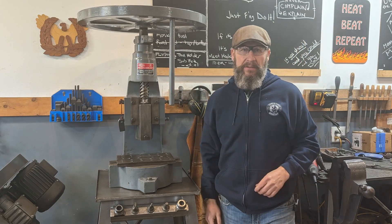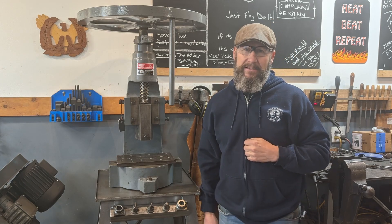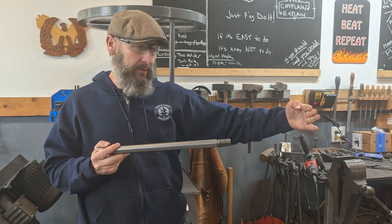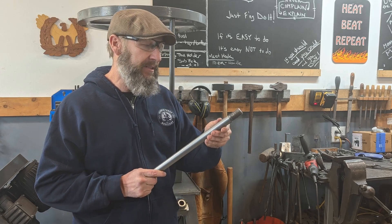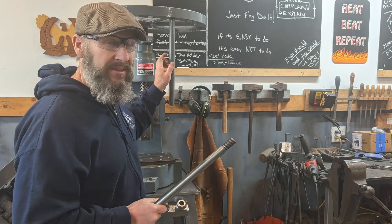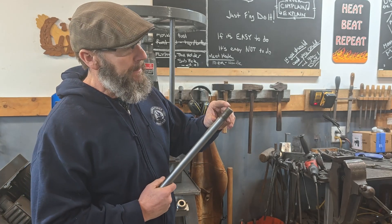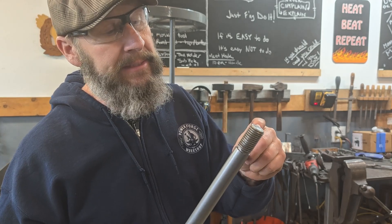I don't think it will be too hard to fab up a couple of handles. In fact, I've already fabbed up one handle rod. I got this from McMaster-Carr — an oversized length of cold rolled steel. It's beautiful finish, very nice. A lot nicer than this painted handle. This is 1 inch diameter stock, and I went ahead and threaded it 8 TPI.